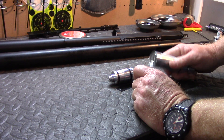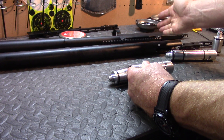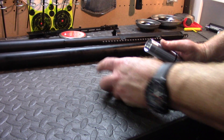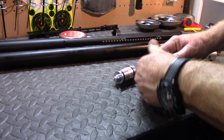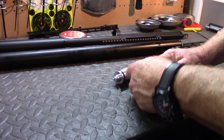This part is not actually ever under pressure because the pressure sits inside the plenum, so it's safe to turn that part of the tube down. But Ed can't turn down more of that tube — at least he couldn't on this design — so he decided to turn the regulator down on the top. That turned-down piece happens to be about the same size as the plenum extension that sits on here.